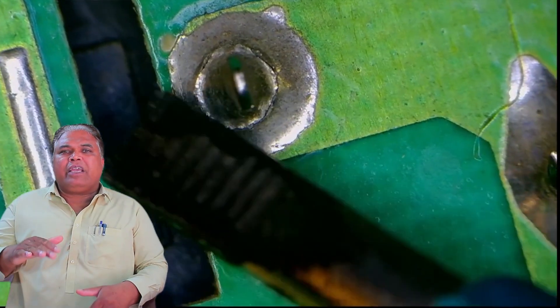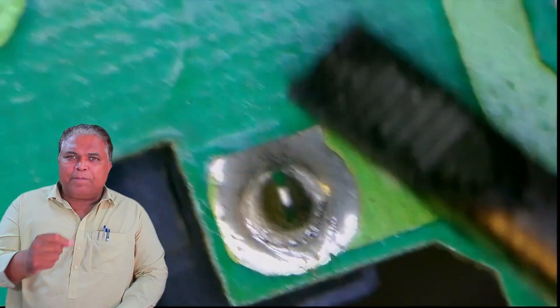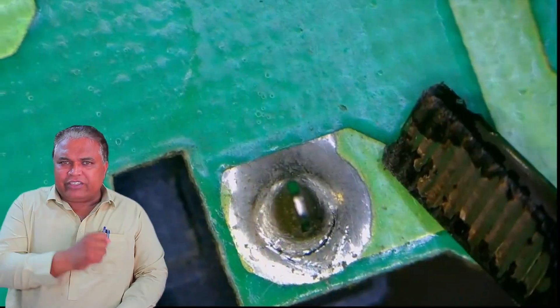Apart from this, if we look at the solder traces on the back side and look at its input and output, this relay has heated up so much that the 12-volt DC supply which energizes the relay has also overheated and its tracks are cracked, which is causing the problem.